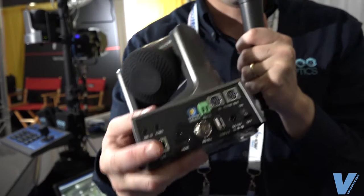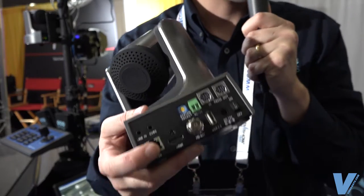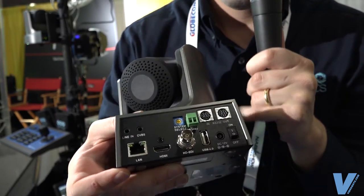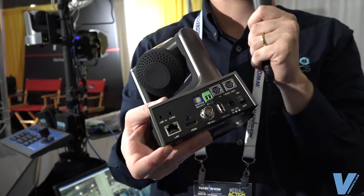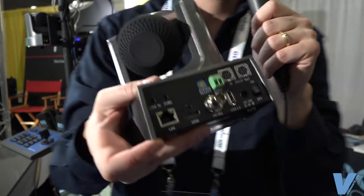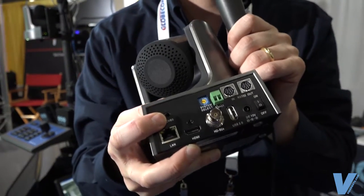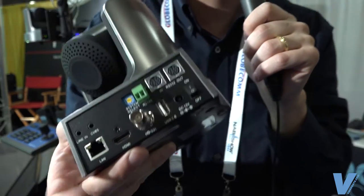What that means is you can use HD SDI for your broadcast switcher, you can hook up an HDMI recorder, and you can stream and control the camera all at the same time. We also have RS-485 and RS-232, so we support basically every single camera control protocol you can think of, including ONVIF and a few others like UVC. We also have an analog output as well, so if you still have an analog system, we've got you covered.